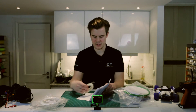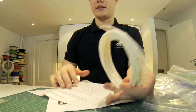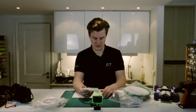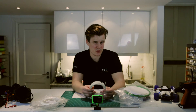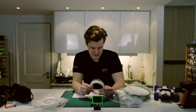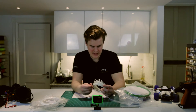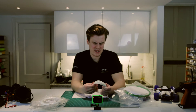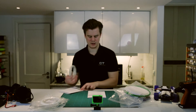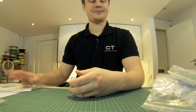We also have a sample from Sakata 3D. I'm just going to read from the paper — it's according to an EN standard, which is really good: no toxic smoke, printing temperatures of 155 to 160 degrees, so it's kind of low temperature. It's a flexible PLA that is biodegradable, which is really nice. It feels like a rubbery finish compared to TPU or Ninjaflex — more like an eraser or similar. There are some settings and specifications on the material as well.